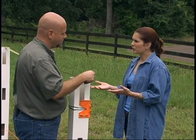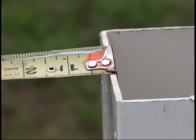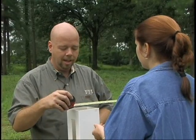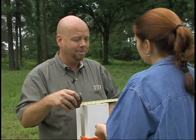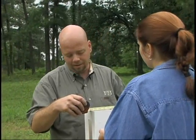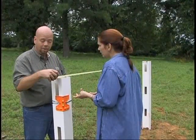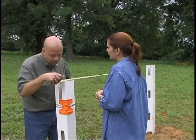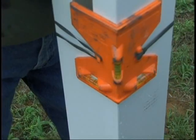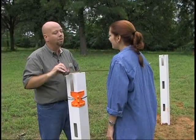How do we know we're on 8-foot centers? What we do is hang the tape on the front lip of the first post and come to the front lip of this post here — that's the same as 8-foot center to center. How do we know it's the right height? We'll handle that later, but the main thing is looking at our levels — are we level? Yeah. Great. If we're level and we're on 8-foot centers, we're ready to go.